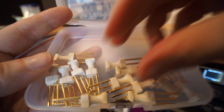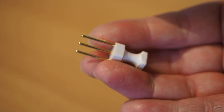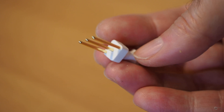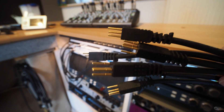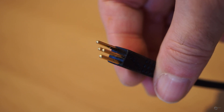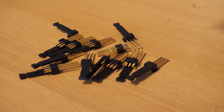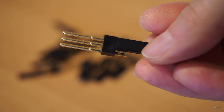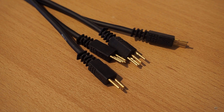Now let's take a look at these very special Kilmetti plugs. What's with this weird pin design? In fact, you have three pins just like with other regular balanced connectors, only the difference is that they are arranged in a diagonal configuration. While the little white Normaling plugs only have three pins, the patch cable connectors have a fourth pin — but this pin isn't used electrically. It only ensures that you plug in the cable with the correct orientation, so as not to mess up the signal's polarity. Solderlux connectors come with a capital G indicating the ground pin. The pin in the middle is for the reverse signal — the cold pin, number 3 — and the one on the right is pin 2, which carries the hot signal.